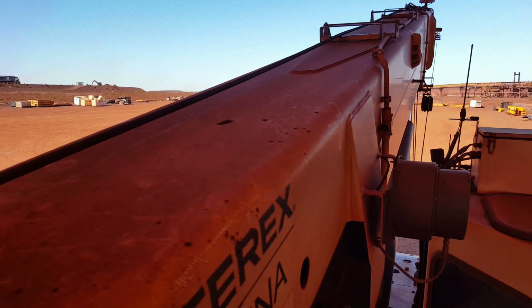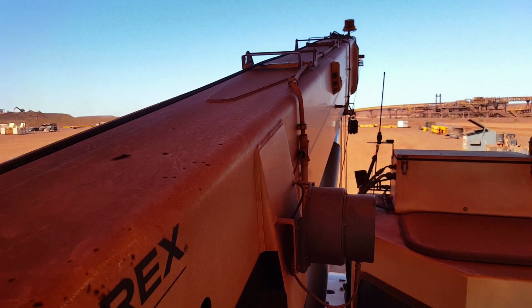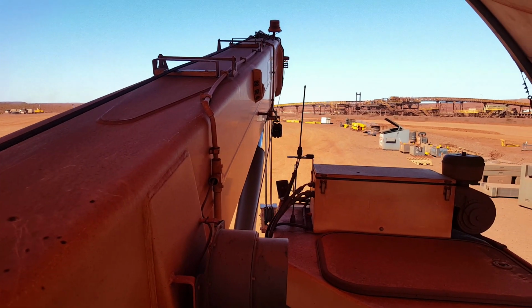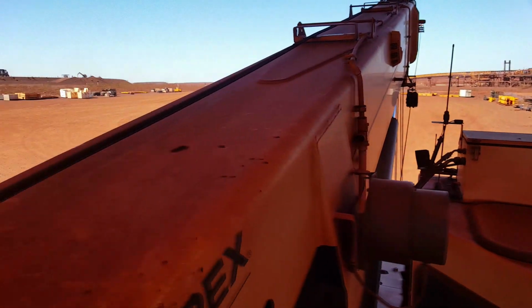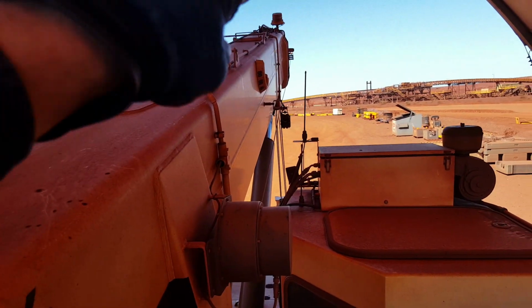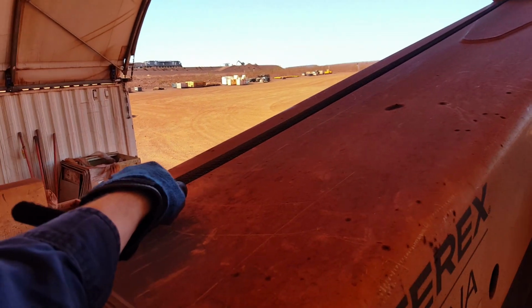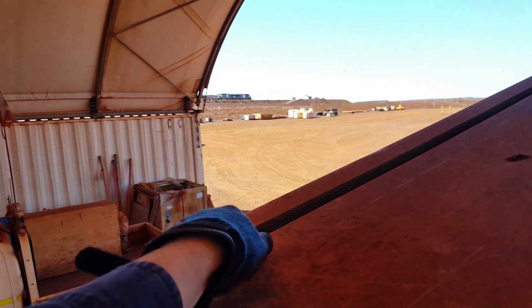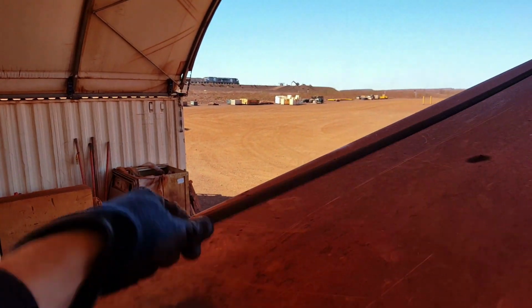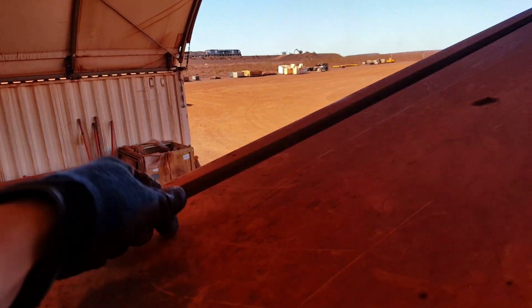This one part of line has 1/4 of the total weight of the hook. The hook is about 150 kgs. So if we had only one part of line to the hook, I'd be pulling on the whole weight of the hook. But at the moment, I'm only pulling on 1/4. And that's why, if I pull this, it's got slop. See, it's got slop. Alright?